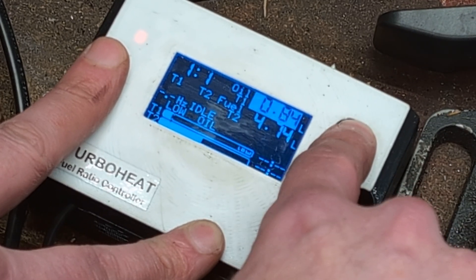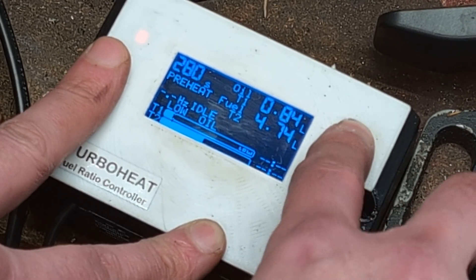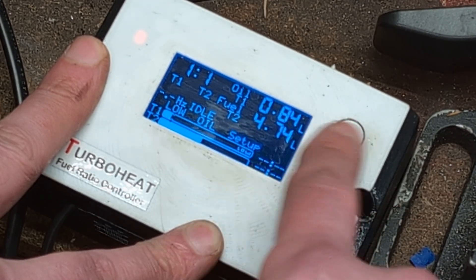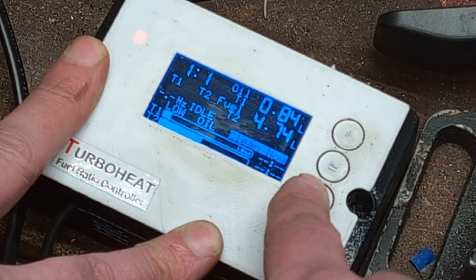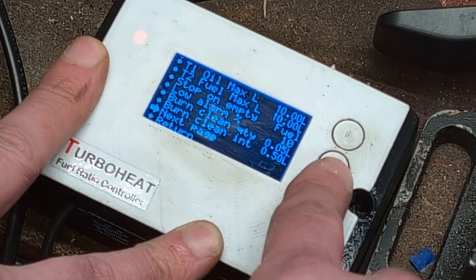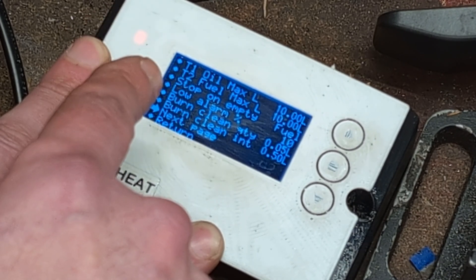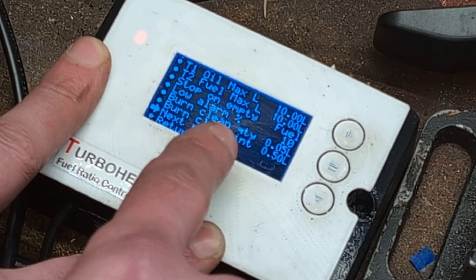The second one, T2, is your fuel — you can see: oil T1, fuel T2. This is just the value it thinks is left in the tanks; they were set to one litre of oil and five litres of diesel when I started. This gauge here is just a visualization of the tank amount, and these dashes here will show you the estimated run time on your fuel and oil. Where it says hertz, that would be the hertz it's reading from the ECU. There's also a low oil warning because we've got less than a litre of oil left. If I keep pressing up, you can set the tank size and that's where you set the time for the preheat.